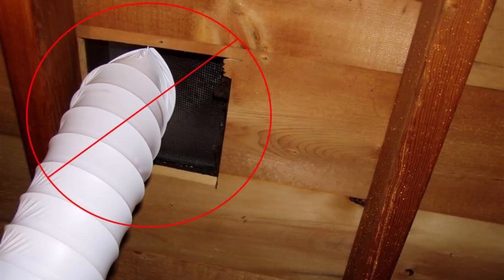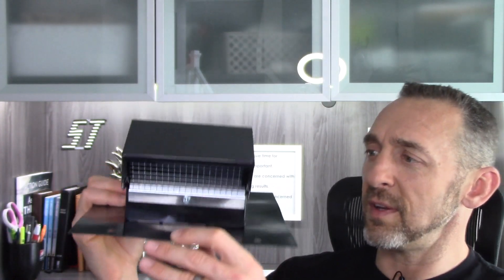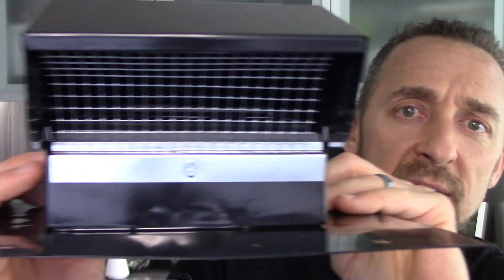Next, make sure that you have a proper terminal for your bath fan. Just pointing it at a roof vent is bad news — you're going to have tons of cold just dumping down that duct and get a lot of condensation forming. It's much better if it's tightly connected to a dampered terminal; that's the only way you should have it. I stopped by the store to pick up a dampered terminal — this is an example of one. This is the Broan 636; it's by far the most common one we see. Easily 75% of them out there are this exact model.